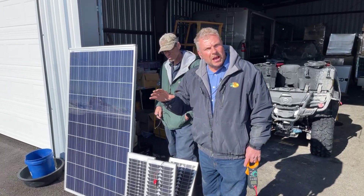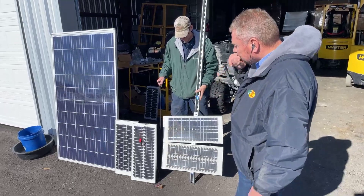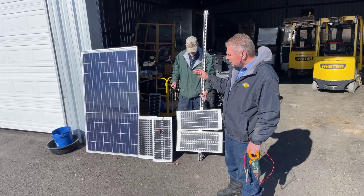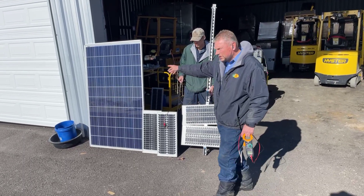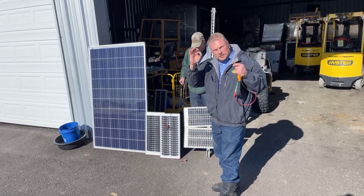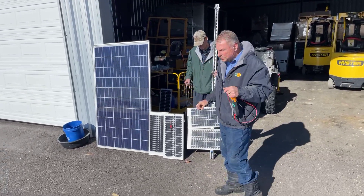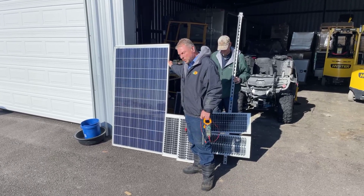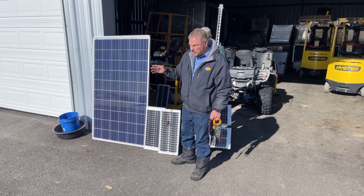The question was: what's the ideal method if I only had four of these small panels? If all four are in parallel they only give four amps, and that large panel puts out eight amps. So we cannot put these panels in series together because it's like a chain link rated for 400 pounds joined with one rated for 200 pounds - the chain is limited to 200 pounds. We know this large panel puts out 37 volts and each small panel puts out 22 volts, so we can get the voltages similar by putting two small panels in series.